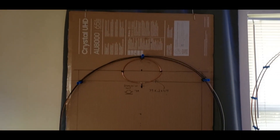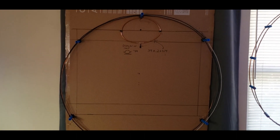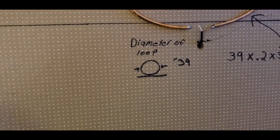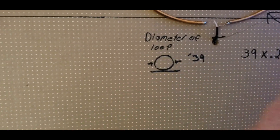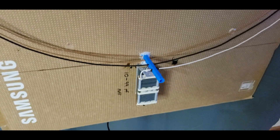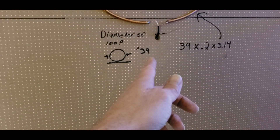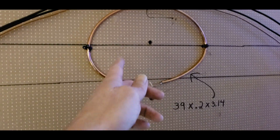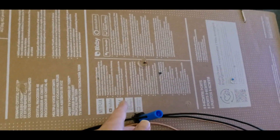It's not hard to build and it won't be in the way — you really should try one. It's pretty simple. You can even guess at the diameter, honestly, because it's going to resonate all through the band since you can tune it with the capacitor. I went to 43 inches, then 51 inches, and just kept working my way down.